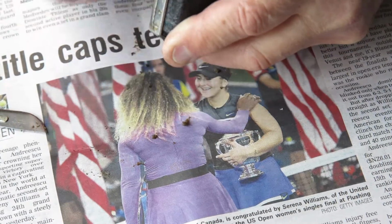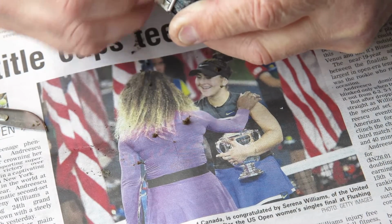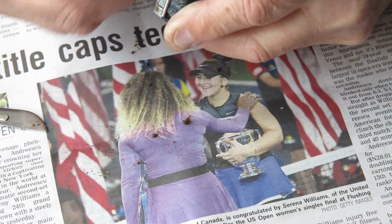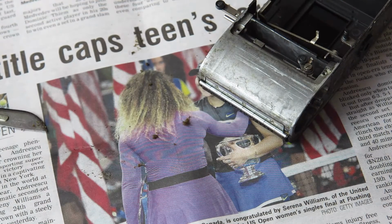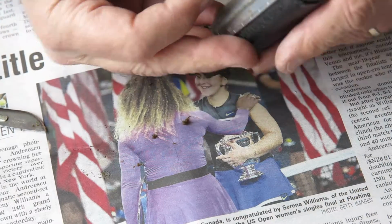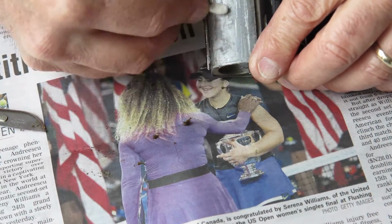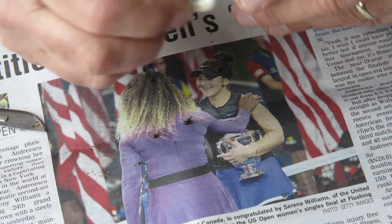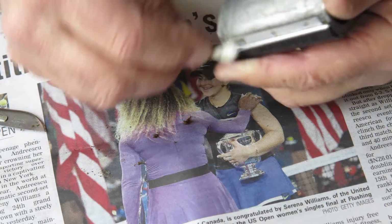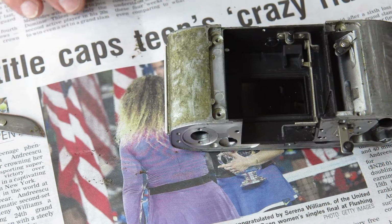It's not uncommon to find a variety of adhesives have been used on an old camera when you come to service it. Many years ago, people would have used shellac. And some of you who have been repairing cars as a hobby for a very long time may remember using gasket cements that were shellac based, brown, fairly pungent, sticky stuff, typically came in a little jar with a brush on the inside of the lid. Well, something like that used to be used as an adhesive for putting on leatherettes, going right back.